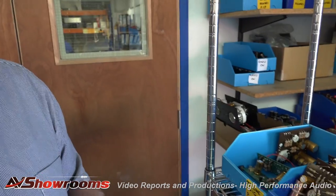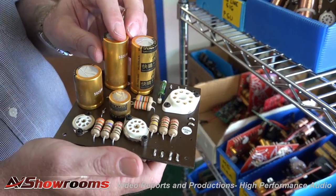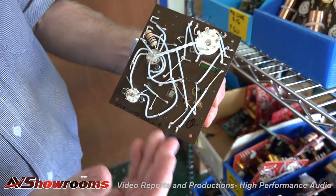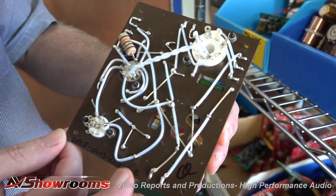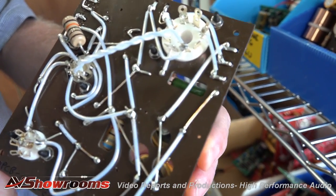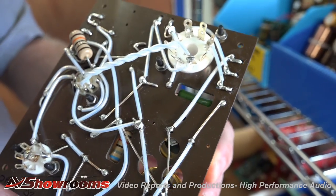What do we have here, Andy? So this is the M6 line signature power supply board. As you can see, we've got the new AudioNote KSI caps, the two-watt tantalum non-magnetic resistors, and the AudioNote valve bases. And if we turn it over, you can see it's all hand-wired with solid silver AudioNote silver wire. We saw how this is done — bent a certain way, then again and again, and finally soldered in place. Most time-consuming, but really the best for the ultimate sound.